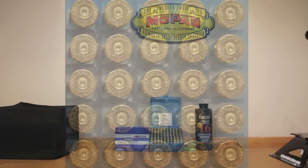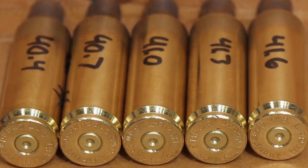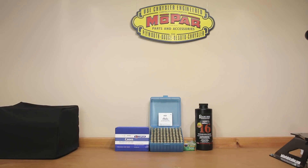I'll put a quick shot of the brass on the screen, and you'll be able to see one of my favorite features of Reloader 16 — even at max velocity we really don't have any pressure signs. Even all the way at that max charge of 41.6 grains, no ejector marks at all, certainly no primer cratering visible whatsoever. I see no pressure signs that make me worried we're anywhere close to the pressure limit for this cartridge, and should we have better groups at that higher load, I certainly would have no trouble looking a little further in that area.